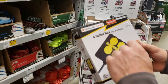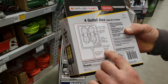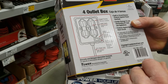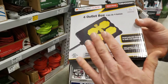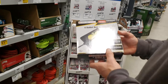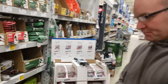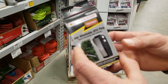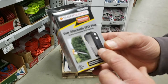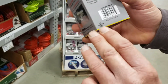Here's a four-outlet box — 14 gauge, three conductors, eight foot cord — and it has a built-in circuit breaker, so if anything happens it's going to pop that breaker. It's UL listed. If you're going to put stuff outside or do this long term like Christmas lights, these are temporary short-term lighting setups. There's also a GFCI plug you can use when working outside — if you're afraid of getting shocked, it will cut the power off.